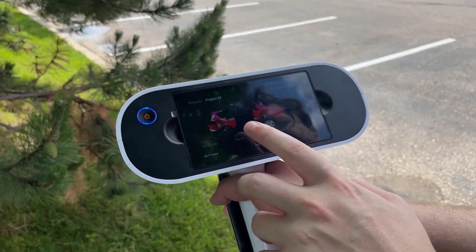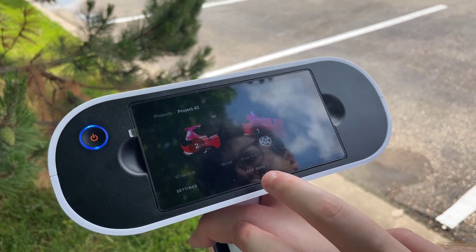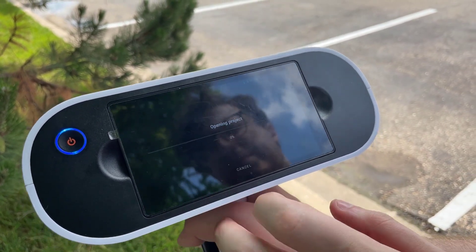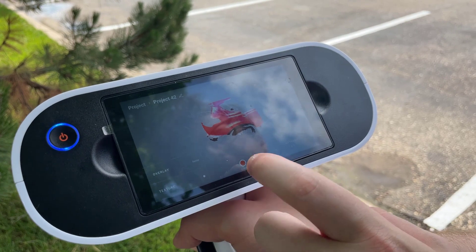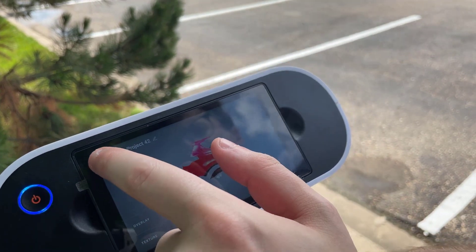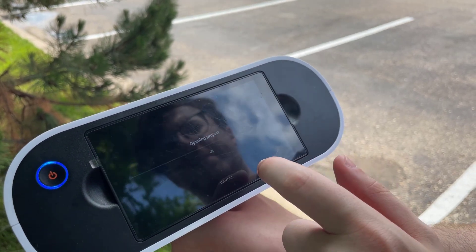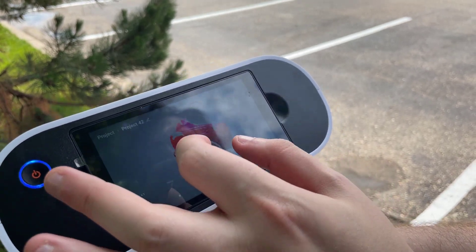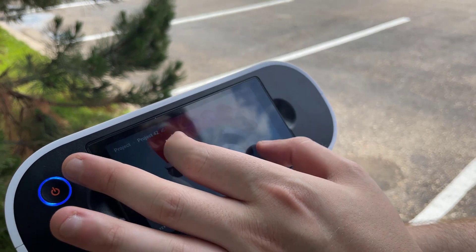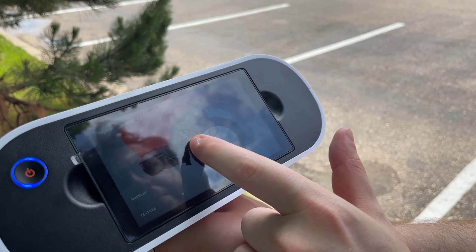When it comes to scanning with the Leo, plan a path before you start the scan. Capture the features that are the most distinct first to give the scanner a nice starting spot to maintain tracking. Your scanning speed will naturally get faster as you use the Leo, which leads to smaller project size and quicker processing times. The Leo is perfect for objects about the size of a laptop to larger vehicles, and it is also great for scanning people due to its fast scanning speed and the ability to capture rich color information.